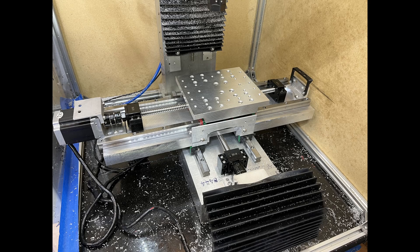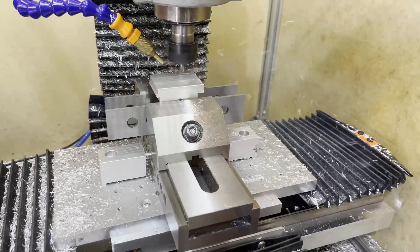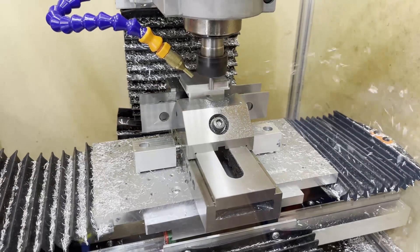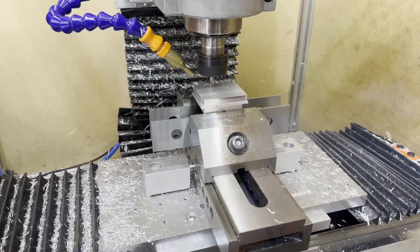Based on all those trade-offs, I think ball screws are the way to go. From the beginning, you can use spacers to compensate for the height difference, and you don't have to make bearing blocks or do anything complicated. You can always come back and mill out pockets for the nuts later. Overall, it's just easier to get a better result with ball screws. They've also come down in price and will continue to. Just be a little careful where you buy them and make sure they have some anti-backlash mechanism built in. Cutting performance was a little better after the upgrade, and the main thing I appreciate is not having to fiddle with bearing blocks or worry about the lead screw starting to slip — overall much lower maintenance.